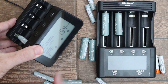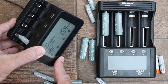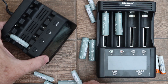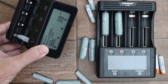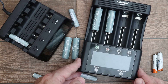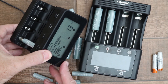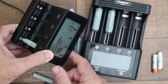The repair function on the PowerX charger, referred to as break-in mode, is excellent. Not only does it work, but it uses a very low charge current of just one tenth of the battery capacity. If your battery is rated at 700 milliamp hours, as these IKEA AAA batteries are, it uses a charge current of just 70 milliamps. A low charge and discharge current seems much more effective when doing a repair. The only problem with the PowerX when doing a repair is time — due to the very low charge current it takes two days or more.